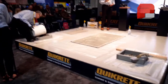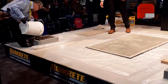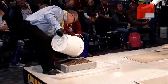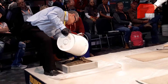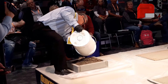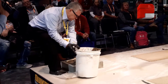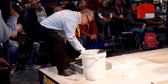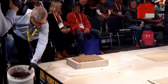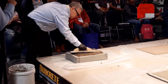As we are simulating here with John, when placing Rapid Road Repair CA you want to apply the material full depth from one end of the repair to the other, and overfill it slightly — maybe about an inch. Rapid Road Repair has properties that allow the material to act as if the slump is much higher once you add some vibration. It's placed in a stiff mix, and when you create a little vibration with the float, it becomes free-flowing.